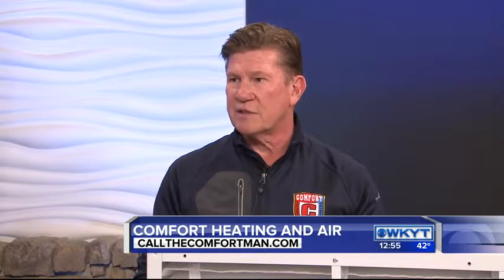Spring is a very good time to do a checkup — perfect time to do it right now. A checkup like that costs roughly $89, and most companies are about that price. We bring new filters, check all the electric components, and check the refrigerant to make sure it's properly charged. HVAC encompasses about 55 to 60 percent of your electric bill, so preventive maintenance is really important.